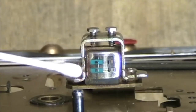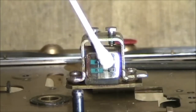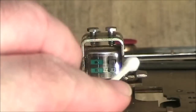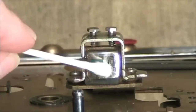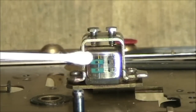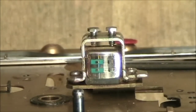I had to examine the head to see if it's viable because this is a used tape recorder. There are some scratches but for the most part it looks pretty good. There's a little bit of grooving because the guide slot was forcing the tape to cut a groove in the head. When I looked at it using a loupe — a high-powered magnifier that jewelers use — I couldn't really see any gap, and if you can't see the gap that's a good sign. The pole pieces are the silver pieces in the center of the blue section, and there's a gap in the middle of each pole piece. If you can see the gap it's probably too large; I could not see it, so I think it's perfectly okay.